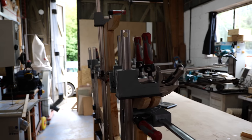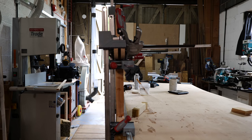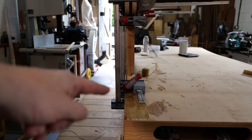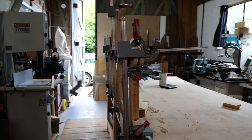Second frame in the clamps. There's definitely a little bit of tilt on this one, but it seems the entire frame is tilted, so I'm not worried about it being out of square to the foot. And even if it is, it only takes a small plane down here, flushing off the joints and slightly getting that edge back into square, and it will straighten this all out.